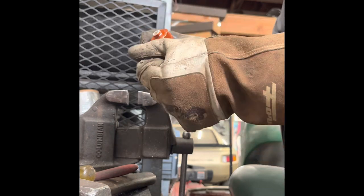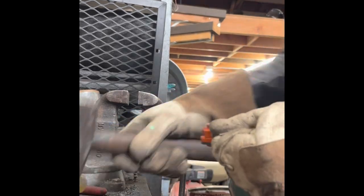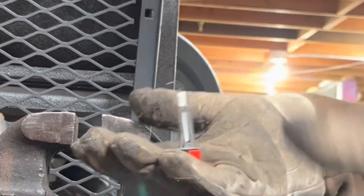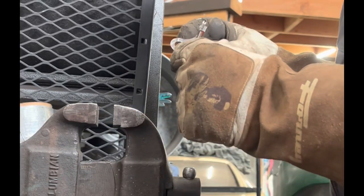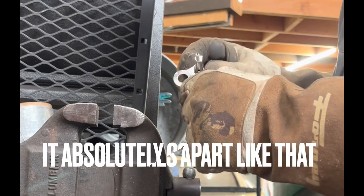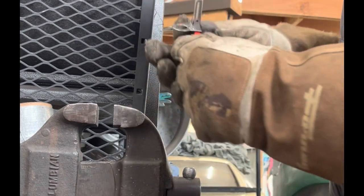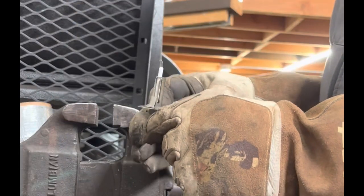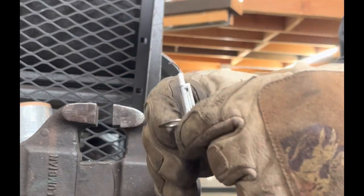So that piece may have been threaded together — you can see the threads on there. I'm the guy out there with the hammer just taking things apart. And this little gem here is the piece de résistance — the igniter. My plan is to probably slot the ring so the hole is open, get it over the stud, maybe cut and fold one edge back, and do tiny little tack welds to get it situated. Then it's game on.